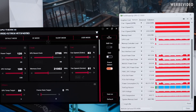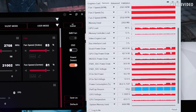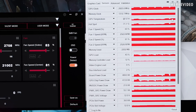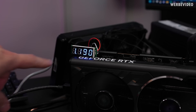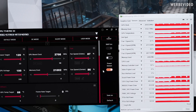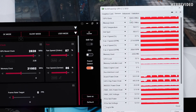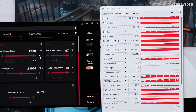The result is a strong increase in board power draw — about 500W where previously we only saw about 260W. Interestingly though, we cannot see the voltage picked up in the GPU voltage reading; it's still reading 1.1V. But it's a strong increase in power draw and also a strong increase in GPU temperature, which is a definite indicator that the voltage has been applied. Another good indicator is that we can see almost 1.2V on the digital multimeter. But the big question is whether we can gain higher clocks than previously. Currently 2900MHz — still quite difficult to increase the clock further depending on the exact position in the benchmark scene, dropping down to 2600MHz at the end.